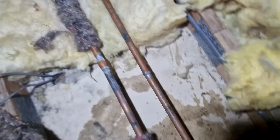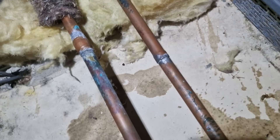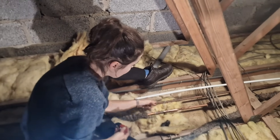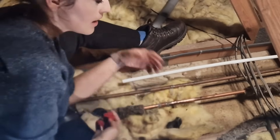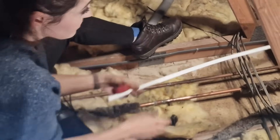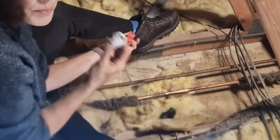I've found my first serious leak — there's a wet patch and a water drip. Let's turn the water off. This isn't how I want to start my morning. I've exposed the joint and it's this one here — that one doesn't look great either but it doesn't seem to be leaking. This is very wet with crud all over either side. I'm going to cut closer to the joint first and then potentially go a bit wider. I might need a longer piece — I don't think there's any flexibility to get a straight piece in there.